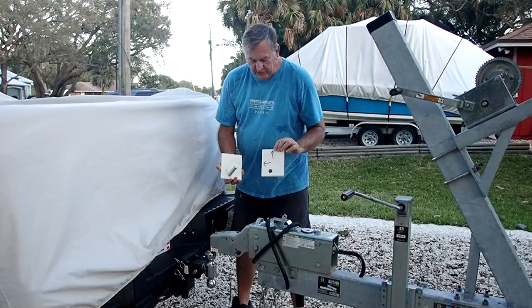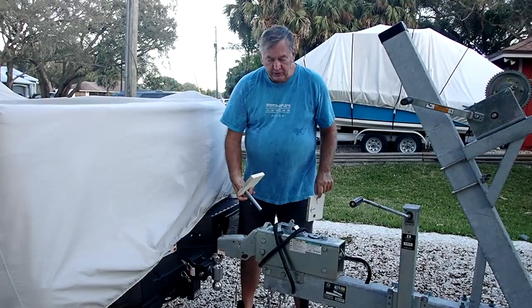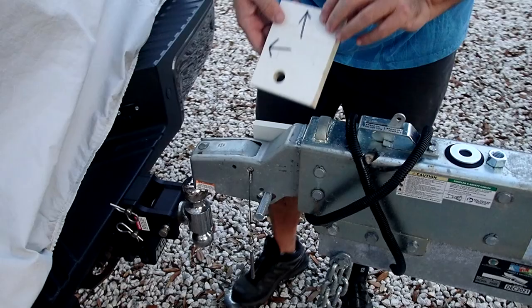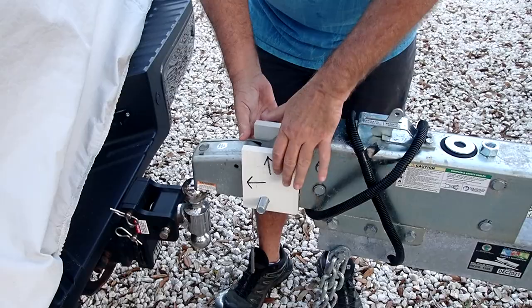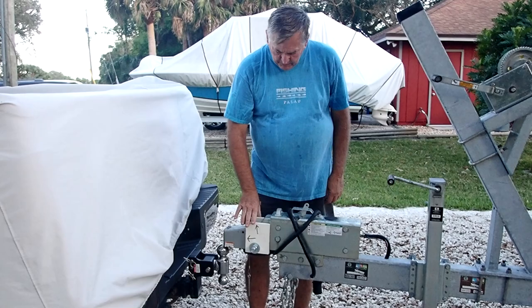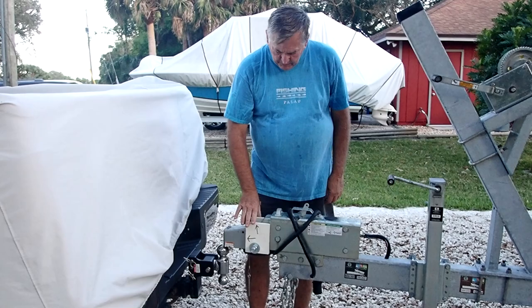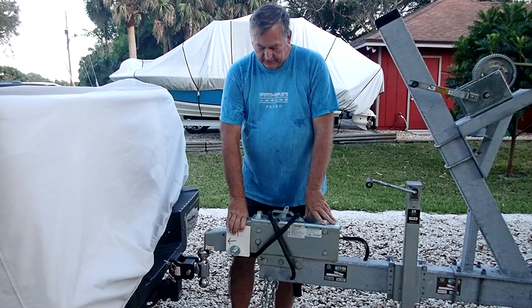There we go — two blocks of wood with a hole in it. Not rocket science. The only thing I did different on the final version was mark 'forward' and 'up' so when you get there at night or you're stressed, you've got it figured out. As you can see, you can do this with one hand — slide that one through, slide this one through, and this nut only needs to be finger tight. One change we decided on: we're going to keep it in the boat, not the truck, because the boat will always be with this trailer but we might have a different truck or tow truck someday. Thanks for watching, I hope this helps.